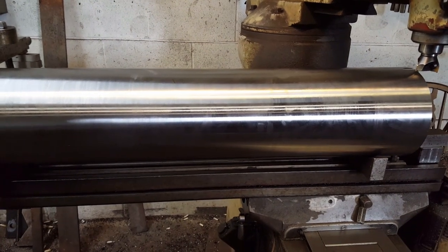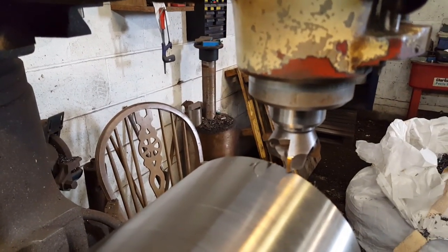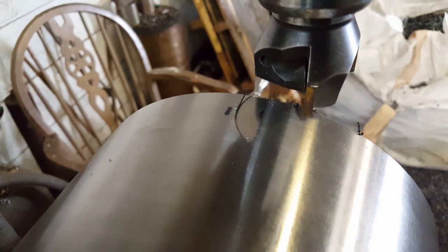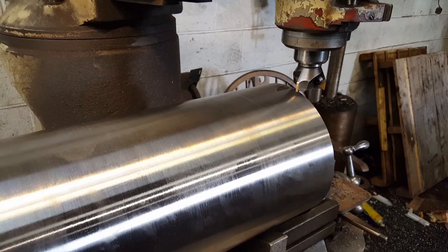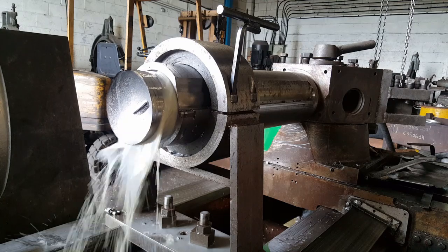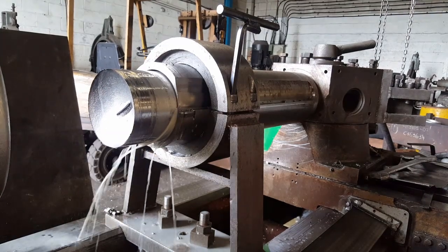Let's find the top dead centre of this tube. I run the cutter on the top just so it touched and then dot marks it, so I can work through the centre line of the tool. That's this one bored with the core stuck inside the tool to extract it. I'll switch the water back on. And now I can just lift it out.